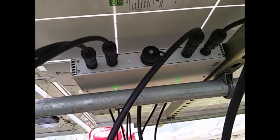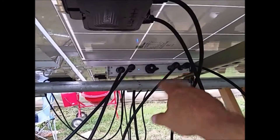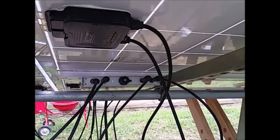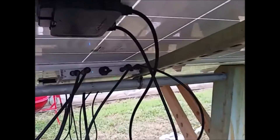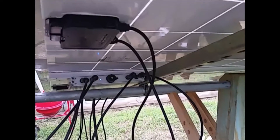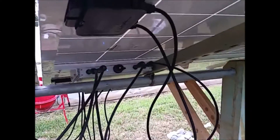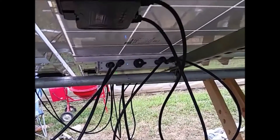This is a second-generation WVC 1200 in service. One thing I learned: I plugged panel A into the first set of inputs and saw around 180 watts — not 100% insolation, a bit overcast, so I was happy with that. Then I plugged in a second panel and saw a maximum of 260 watts. I'm not sure if the issue is with the panel or the inverter — I need to do some A/B/C/D matching to see if the inverter isn't equally matching output across all four inputs.